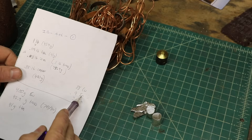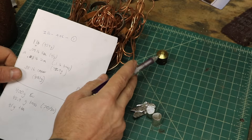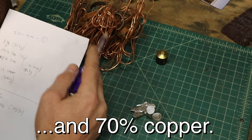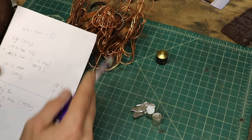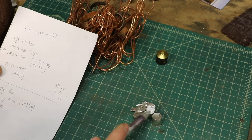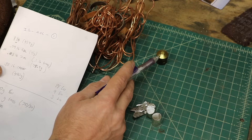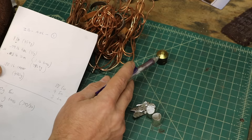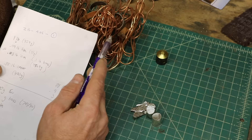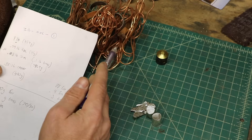The composition is 88% copper, 9% tin, 3% zinc. My source of zinc is going to be this brass, which is 30% zinc. I've got plenty of copper, and here's my tin. So what I need is 41 grams of tin, which I've weighed out, 45 grams of brass — 30% of that is zinc — which gives me the correct 3% zinc, and then 400 grams of copper. Then I can pour an ingot and do some testing on it.